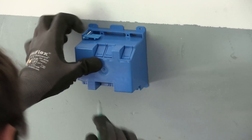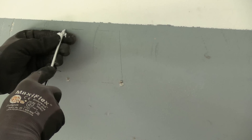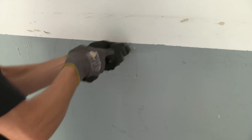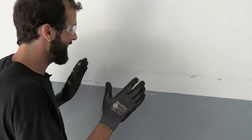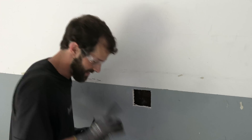If you're a Jefferson Electric apprentice: always pencil, never Sharpie — you never know when something goes wrong and you have to rework it. Check the wall for depth and obstacles and make sure it matches your box. Using a drywall or keyhole saw to cut the opening — you can use a utility knife and oscillator, but the keyhole saw is quick, manual, cheap (about $8), and keeps the dust down. Any time you use a powered tool the dust plumes, meaning more cleanup. Interestingly, the wall is uninsulated — garages in 1982 apparently did not require insulation, which will make our fish much easier.